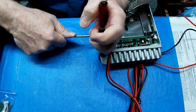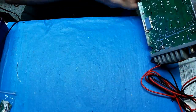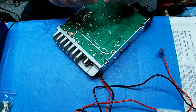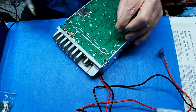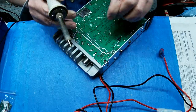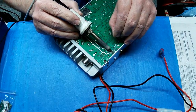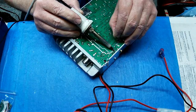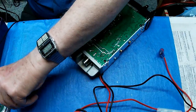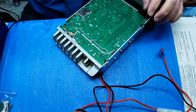Grip it. You can go ahead and tighten this one like that because the leads are going through a hole in the bottom of the board that keeps the component from twisting when you tighten it down. Break out another roll of solder here in a minute. That one's almost empty. Okay.